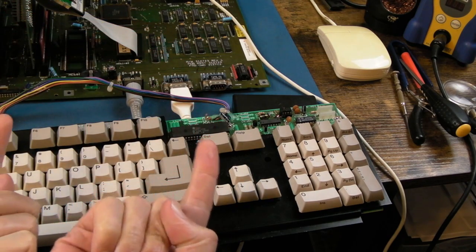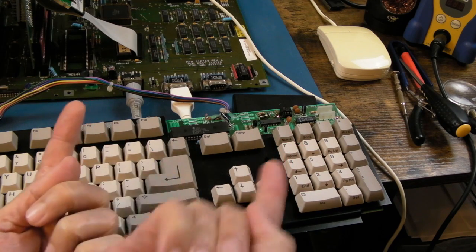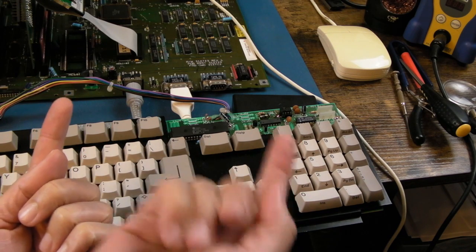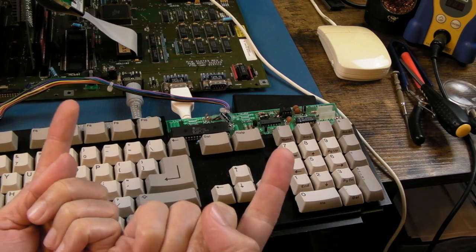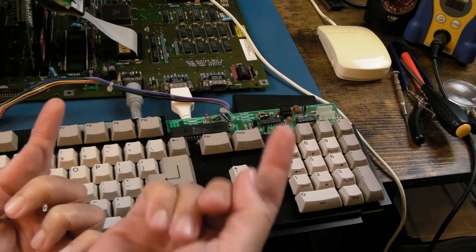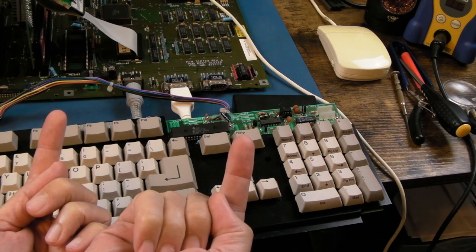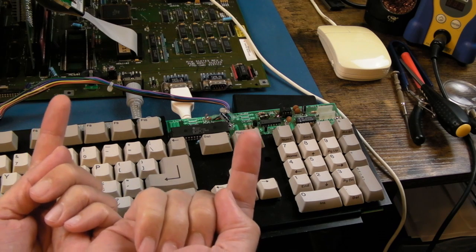You stick some capacitors in there, you've now got a constant in terms of it being able to get the correct phase adjustment there and get the exact frequency kind of locked in, if you see what I'm trying to say. It'll just naturally resonate to, in this case, 3 megahertz, and there's going to be temperature and humidity and all these things that just might make slight variations.